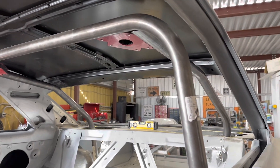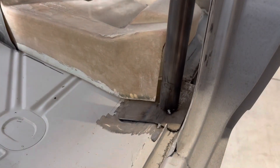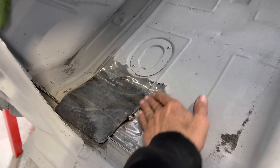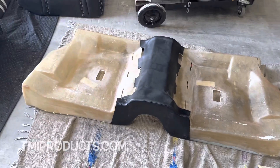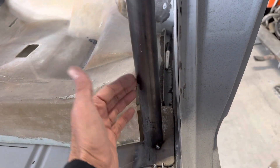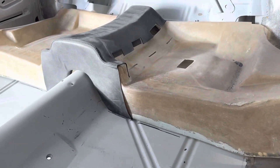I'm happy. My year is off to a good start — I got lemonade out of lemons here. As for the rest of the roll cage, I've tack welded my floor plates in after putting them in a vise and hammering them to match the contour of the floorboard. Take a look at the seat here. This is the TMI Products seat that I had to take the upholstery off and get down to the fiberglass core. I had to do quite a bit of trimming along the back to work around the wheel tubs and also in the front corners where it comes up against the roll bar. I've trimmed it back and it's in there pretty good. And the roll bar is looking sweet.